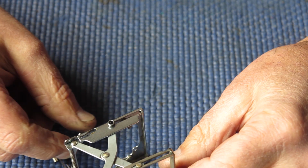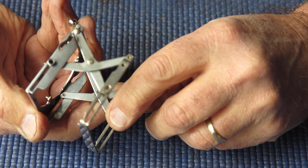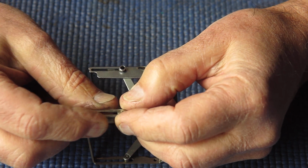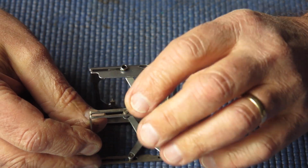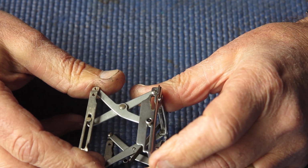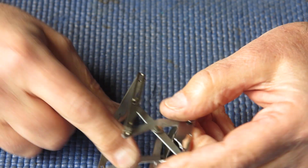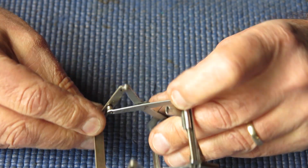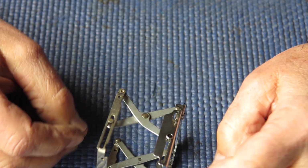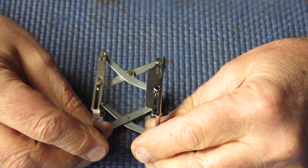So hopefully, if I rivet this over a bit firmer, cross in that track slightly so it's slightly narrower at this point, and clean these struts up, check to make sure that the arms aren't bent, that the ends are at 90 degrees. Hopefully, once that's all done, the struts will be fit for use again.